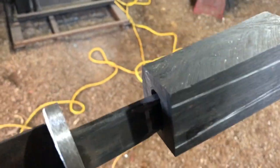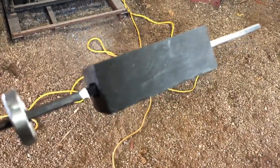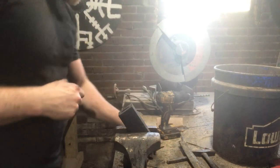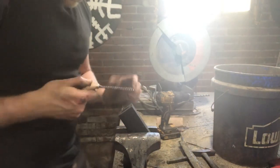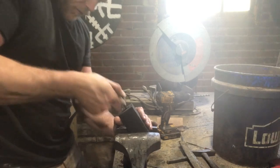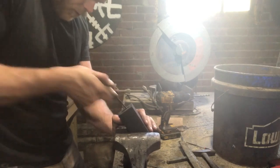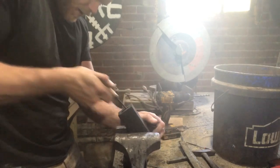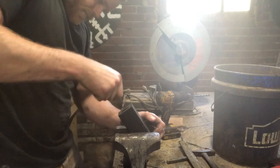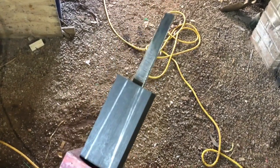Took as much off the tang as I'm willing to take. We still have space on the top as well as the bottom, which tells me we've got an hourglass shape in the channel rather than a straight one. To fix it, I'll take an angled broach and use the point to scrape material from the middle of the channel out on all four sides — check and recheck until it's where I want it. Now we're talking. We'll repeat that exact same process with the pommel.